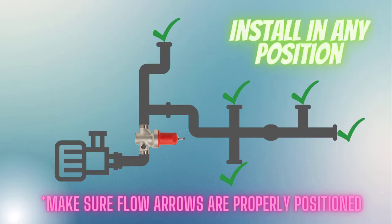Getting the valve before water usages helps guarantee that you'll have constant water pressure across all water usage on your system.